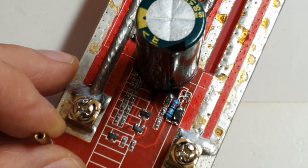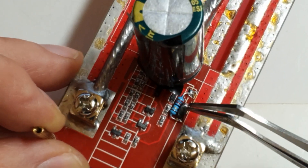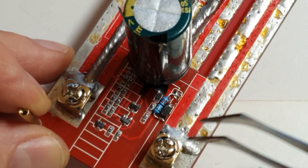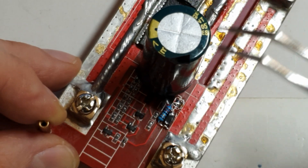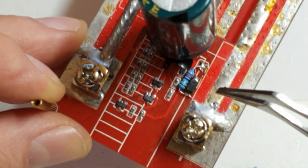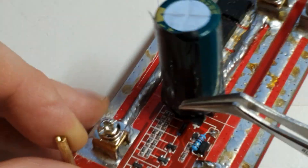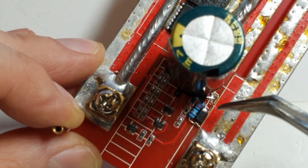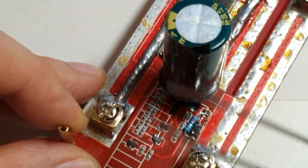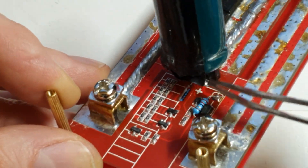Check your diode before doing the mod — if it's new it will be fine, but if you've been using it and noticing issues, check whether it's shorted or not. Mine isn't shorted. This is because I did some testing using a power supply connected in parallel, limited to 1 amp on purpose, so when testing I could short it out and do various tests without blowing it up. That's how I diagnosed the problems.